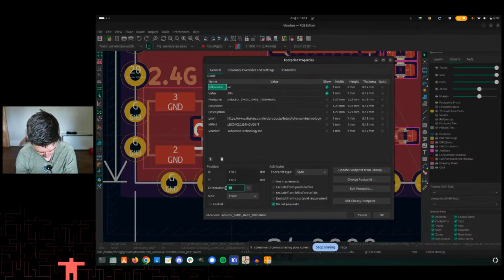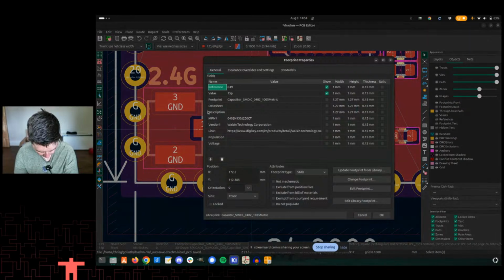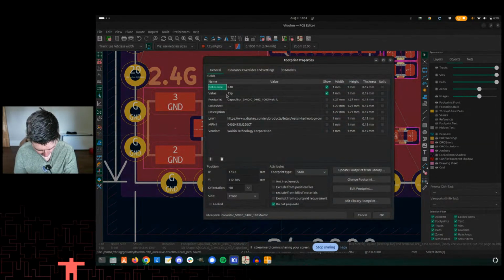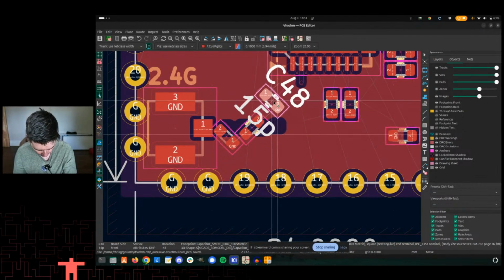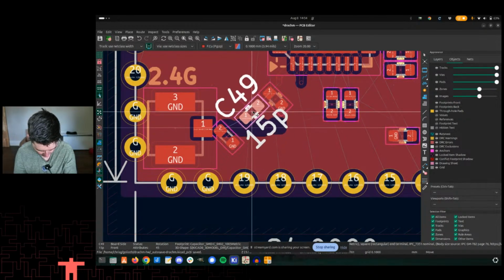Go to the general, I'm gonna offset it by 45 degrees. Sometimes when you're looking at a board and you're like, why is that a weird orientation there? Sometimes it's because they want the same kind of thing and have better signal integrity. I'm not sure that's actually the right term, but once you're on a 45-degree angle, you can just rotate this thing to match what you need. Okay, so now should be able to rotate it like this, and like this.